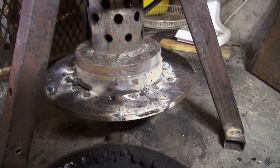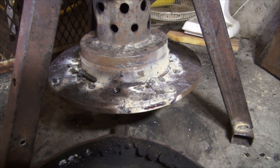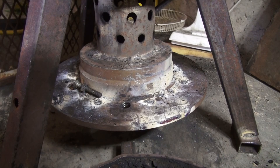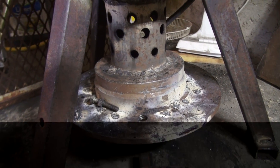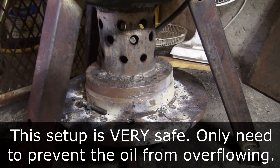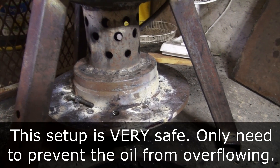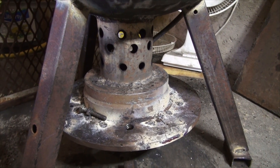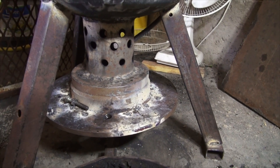Right now two 7/16 holes is all I've got in here. The third one I could add to increase the temperature, but it's perfect actually for the shop. I don't have to adjust much, and it's burning a little less than a liter of oil per hour, so that's very good.